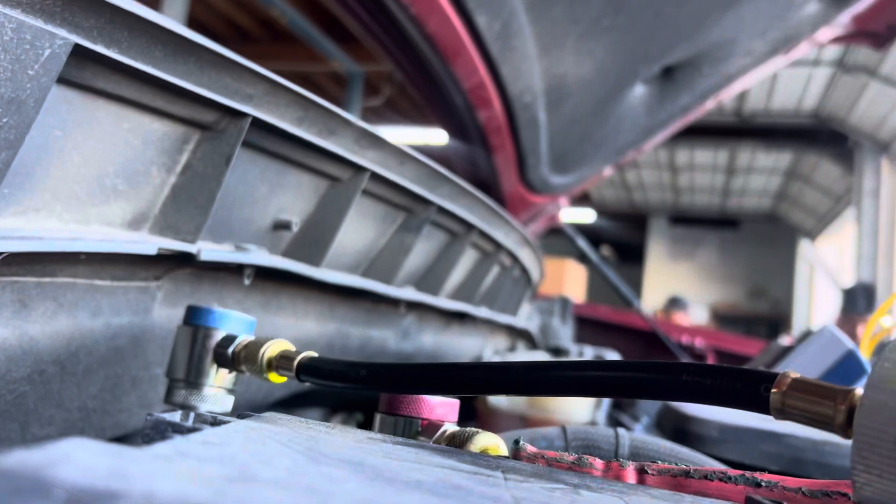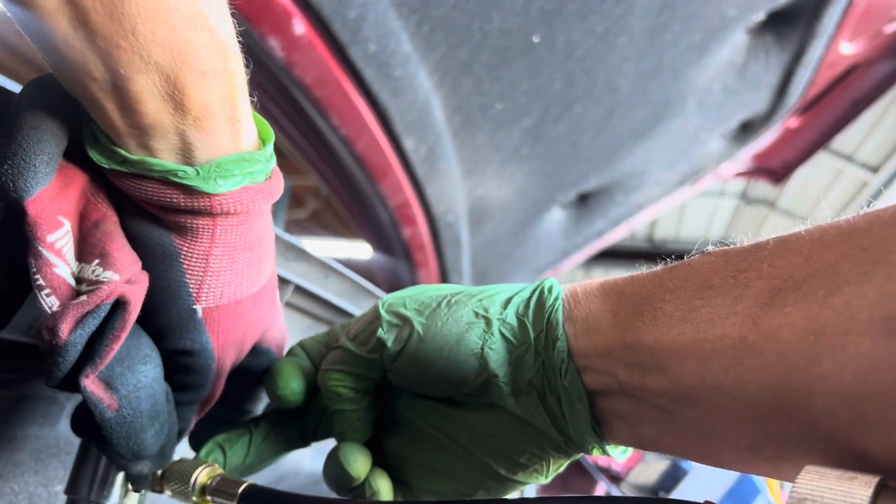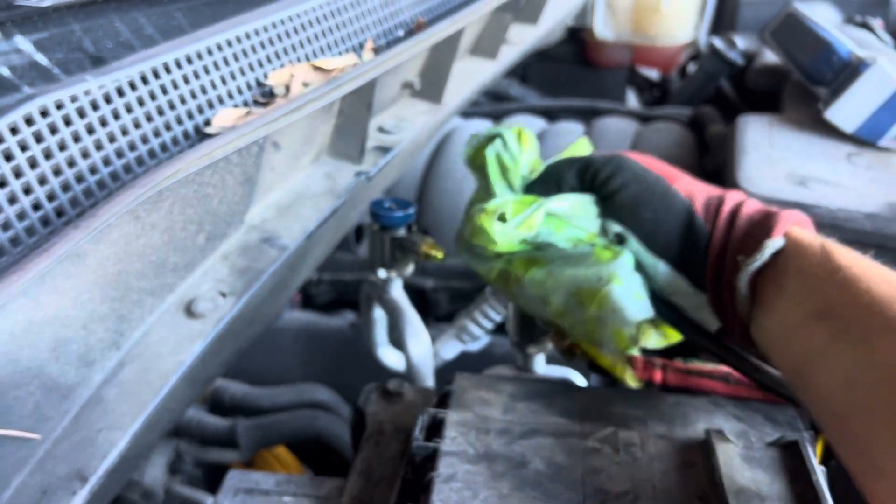I'm screwing the oil injector in - that's 45 milliliters. I'm screwing this in. There's another glass one I want to get but you'll see that in another video. Okay, it's all in there - oil right up to this fitting. I don't take this fitting off because if there's a weak spring in the valve core it'll suck in air, and I don't want that.